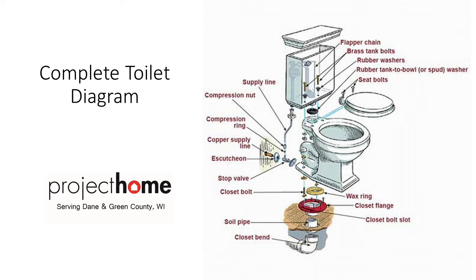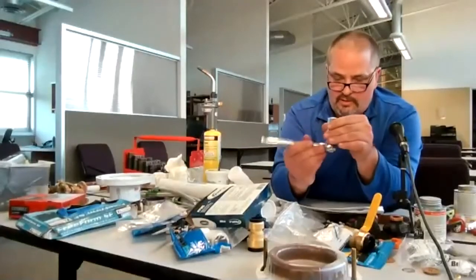Underneath the toilet is your closet bolt and your wax ring. You just got to line it up properly and set it, wiggle it on so that the toilet sits on the floor. With your new toilet you've got seat bolts — that's all in the box when it comes with the seat. The tank will have a new rubber tank bowl gasket that goes onto the tank threads. Then you've got two bolts with rubber washers. I use a ratchet with a half-inch extension to tighten the bolts quicker.